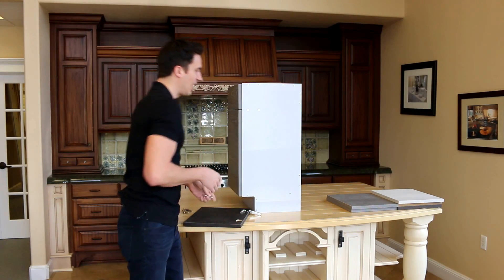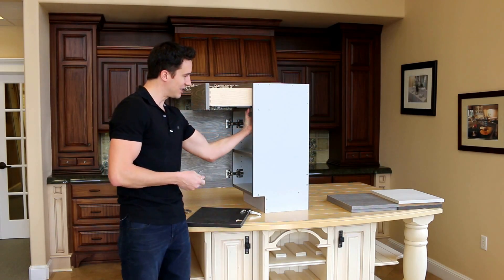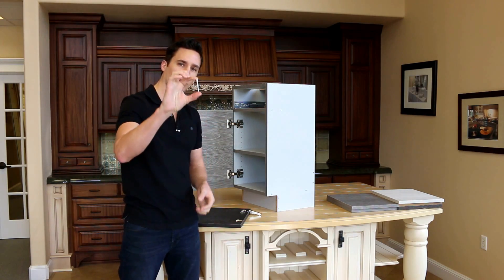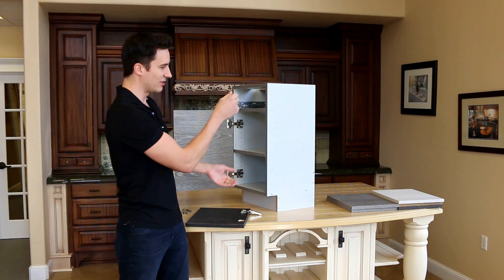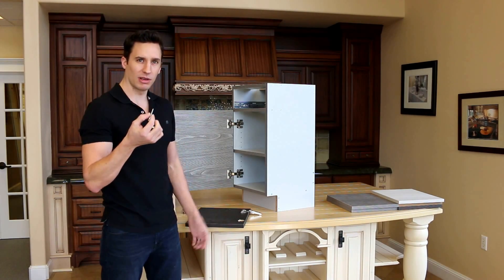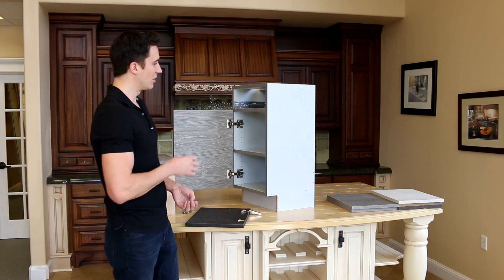As far as assembly is concerned, everything goes together and this is pretty much a very impromptu assembly tutorial. All the holes are pre-drilled in your pieces. You have a deck, some top stretchers and a drawer stretcher. You simply take the cabinet part - there are holes drilled into the side of your drawer stretcher. You take your screws - what we call a confirmat screw. This is a heavy metal bolt. You attach it through the pre-drilled holes on the side of the cabinet, align the holes and then screw together. That's literally our assembly. Things are super simple and super durable. The reason we use plywood core is because the combination of plywood, solid wood, and a metal bolt creates a cabinet that's indestructible. We've been selling these for almost 20 years, and our new modern line takes all of our tried and true construction methods and applies it to a more contemporary cabinet.